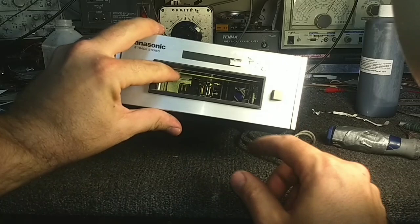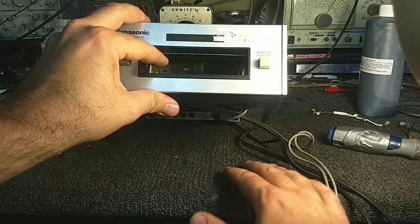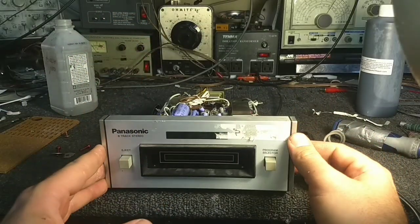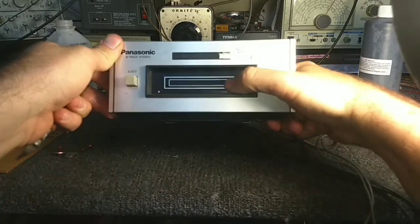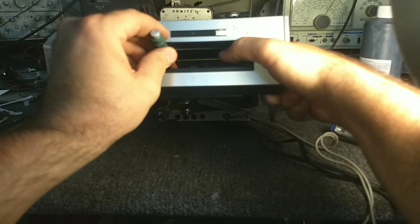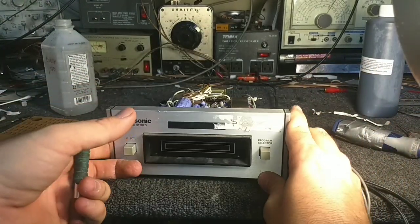Okay. There's also the little butterfly sensor back there. Make sure that's clean too. You'll probably need to get back there with a set of hemostats and a Q-tip. That just rolls over a piece of foil on the tape to tell it to change tracks. It usually makes the circuit for the solenoid. In fact, I can demonstrate that by turning on the motor and I'll touch these two points together and you can hear it change the track. So that's me emulating the foil. Okay,